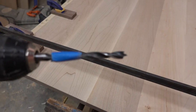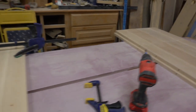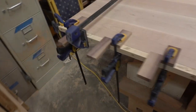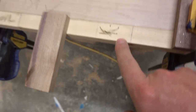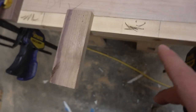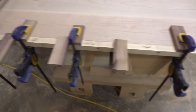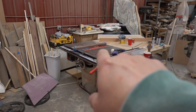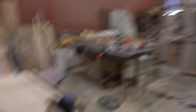The other thing I did was I measured and I set the depth on my drill bit on how far to go. That is a 5/16-inch bit — that's what fits for this. As I clamp it all up, you can see I have the same reference point for both of them. Then I just make sure all these are flush. By the way, I messed up on my jig and had to pull these off and move them — make sure that you put them in a spot where you can get your drill in, because I had these things sticking out where I couldn't do my drill. So had to pull it apart real quick. That's why you test everything and do samples over on my bench right over here. I did a few tests to see if it would work and everything would line up, and it did. So after doing several of them, now I'm able to do it.